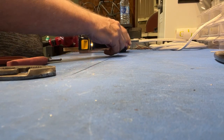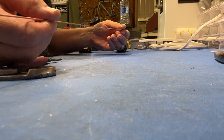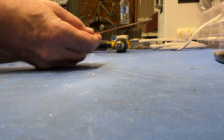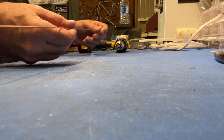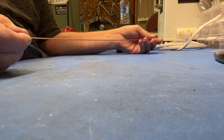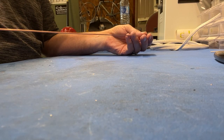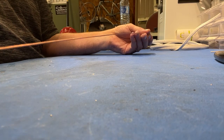And what you get is a really nice straight wire. Isn't that amazing? I was so happy when I learned this trick because it made life so much easier than trying to bend it with my hands — I could never dream of getting it this straight. So there it is: take your wire, strip it out of some 14 gauge Romex, stick it in the drill, hold it with the pliers and give it a spin, and you get a nice straight wire. Cheers.